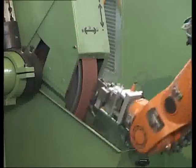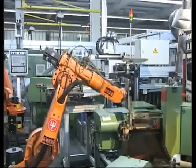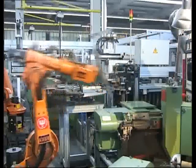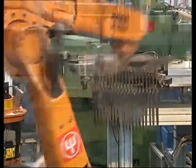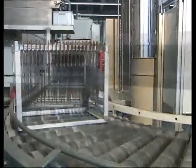Now the spine of the blade is finished. The blades are polished to achieve a fine satin surface, then thoroughly cleaned in an ultrasonic unit.